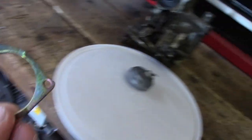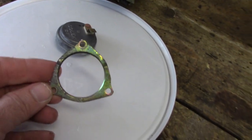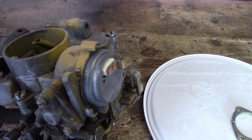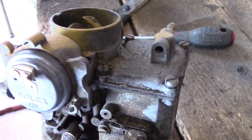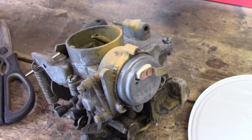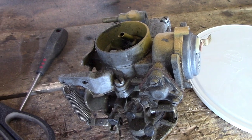This sort of anodised ring that sits around it and holds it in place — I concentrated on one end a bit and then left the other, and it seems to have come out okay. If I was to put that back on, I'd say that was a bit of a success. I think it looks really good. Could you get the same effect with a brass wire brush and some WD-40? Maybe. But it's a dry method, so it doesn't go everywhere. And the handy thing with bicarbonate soda is that it's water-soluble and environmentally doesn't have any problems, so you can just wash it away. I'll show you the mess it made in a minute.